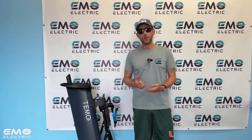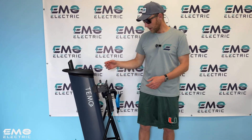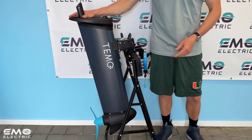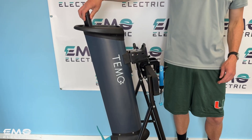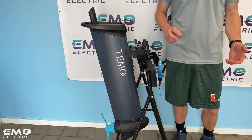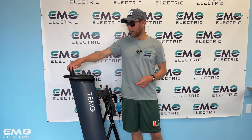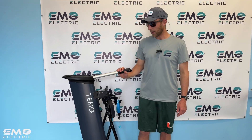The other cool thing for sailors is if you're using this on a sailboat and you want to use the sailboat's rudder to steer, you can actually lock the steering by pushing this lever up. And then you can still use the tiller to control your speed when the tiller is stowed away. So depending on the setup for your sailboat, it might be really nice to be able to control speed like that, rather than having the tiller out where it might get in the way.